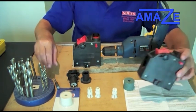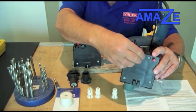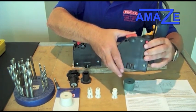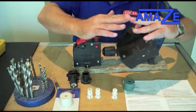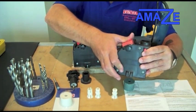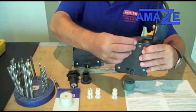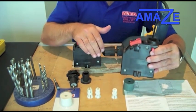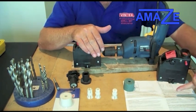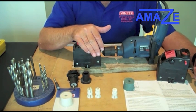We sell a lot of these kits to tradesmen for this reason: on the side of the kit there is a lock nut. If you undo the lock nut, that allows this cam system to move up and down, so you can actually change the cutting angle of your drill bits to suit different materials. Generally though, you lock this at 118 degrees for high speed steel bits — that is the general purpose cutting angle of all drill bits when you first buy them. However, there is a chart in your instructions that tells you what angles suit what materials, if you want to change your cutting angles.